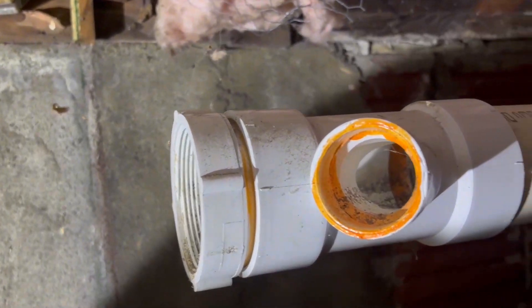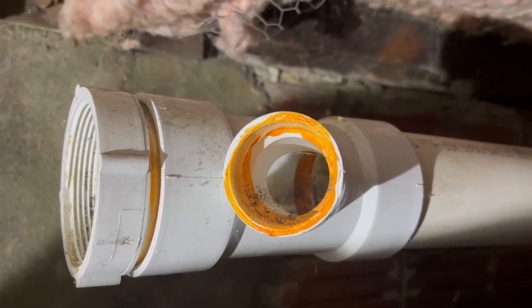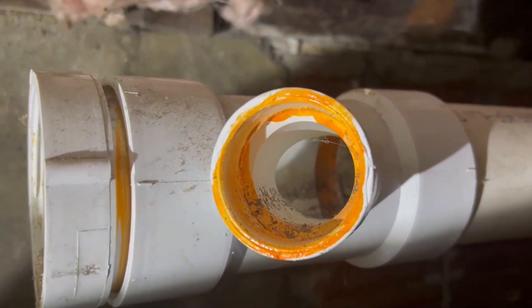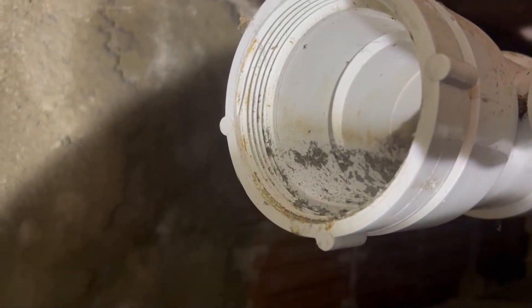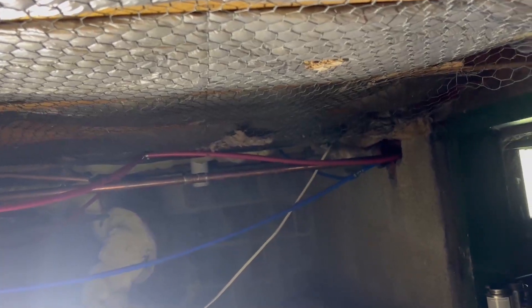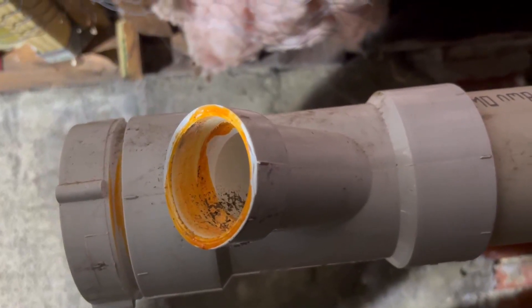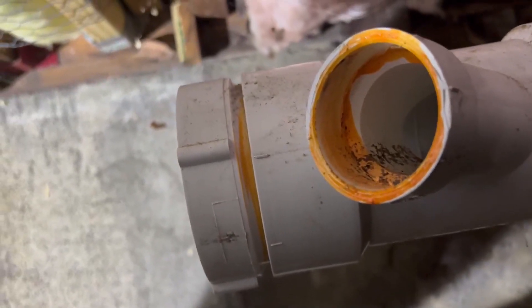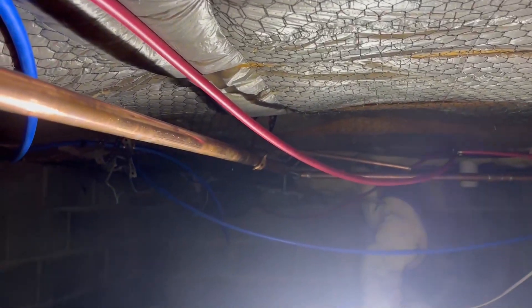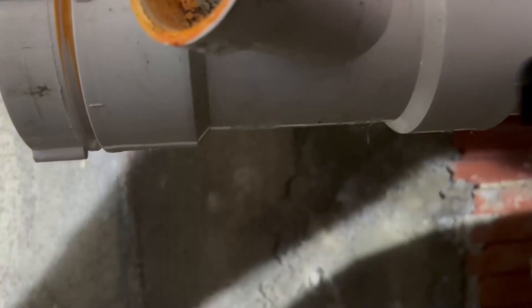So I'm under the crawl space here. As you can see, this is the pipe that I need to tie everything into. It looks like at one point they had an inch and a half for maybe the vanity connected in there, but then they put a clean out on the end of this. I need to go straight over there to that pipe hanging down — that's the pipe for the toilet that I just put in. I'm going to cut this Y off right here and then get another Y with the same configuration — inch and a half coming out to three inch here — because I'm going to need to grab this inch and a half when I go over to the vanity and then to the wall for the washing machine. So let's do it.